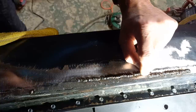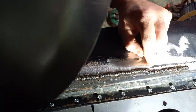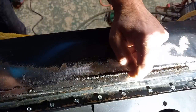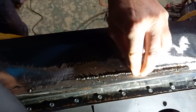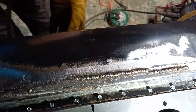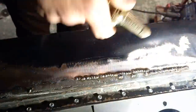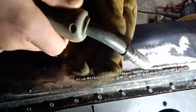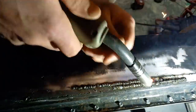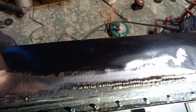This is highlighted, I think, all the way down here with that crack. I haven't got penetration all the way along there. See where the heat has moved the metal very, very slightly. You can see this starting to open up, I think. Yes, I think I'll carry on spotting down there to about here somewhere. Right, I think we got it all.